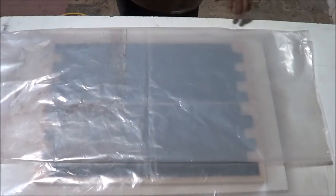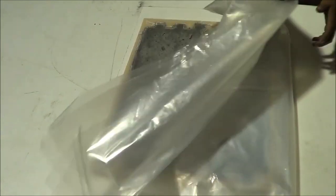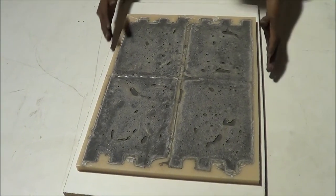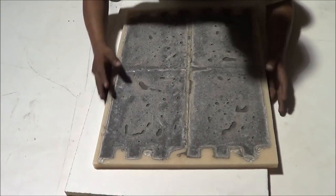The best way to store the stone is by covering them in plastic at a temperature above 70 degrees Fahrenheit for about 12 hours. The plastic prevents excessive moisture loss and maintains heat of hydration to ensure a proper initial cure.